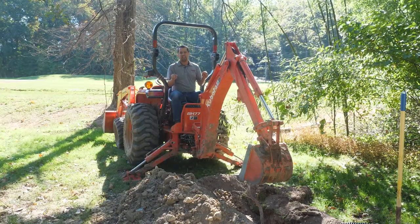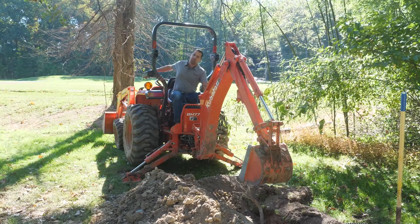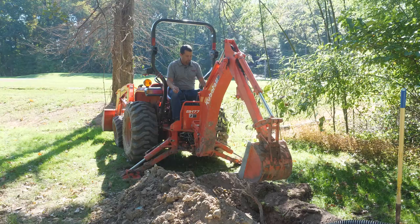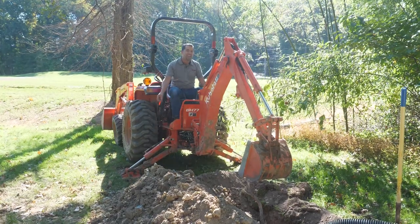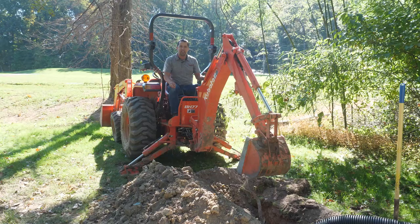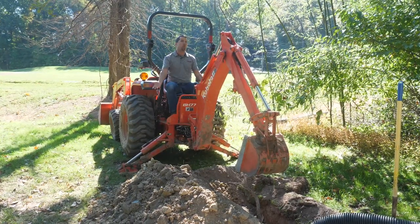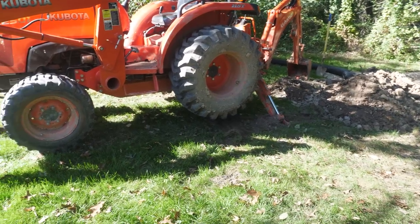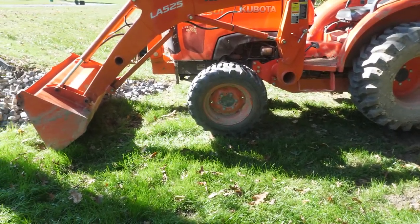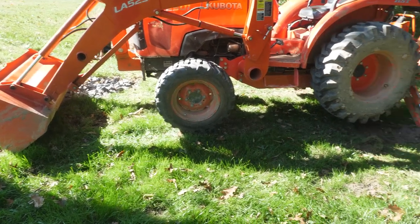As I'm sitting here in order to move the machine, I have my loader bucket up in the air and I do not have my parking brake set. I'm going to have the backhoe kind of planted in the ground by having the outriggers down. If you're doing the hardest of hard digging, this is not a great idea — the tractor is definitely going to be more planted if you have the loader bucket down on the ground and the whole tractor picked up in the air, getting as much weight as possible on the outriggers. So I'm giving up a little bit of plantedness in order to be able to move the tractor along.